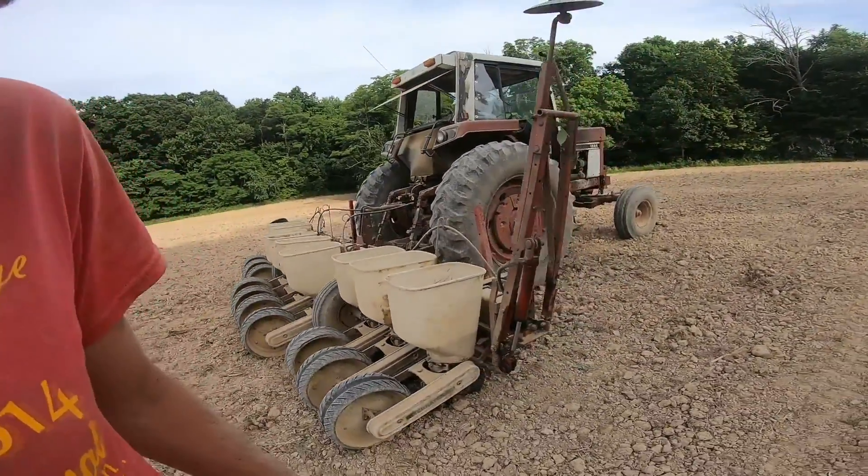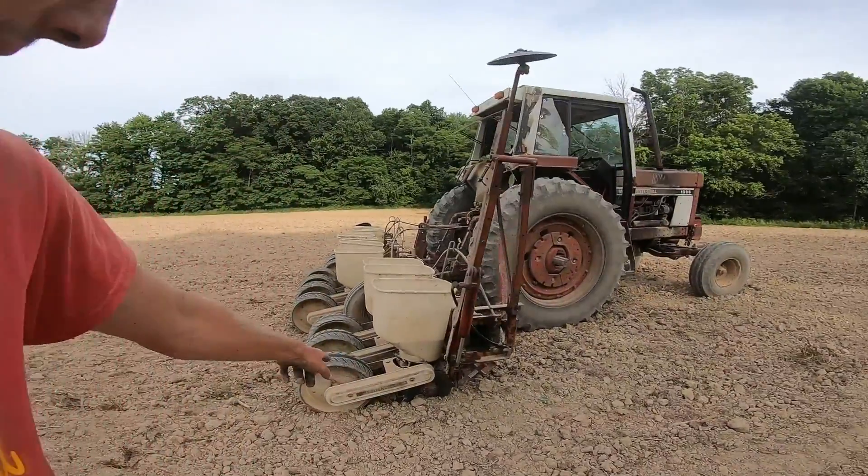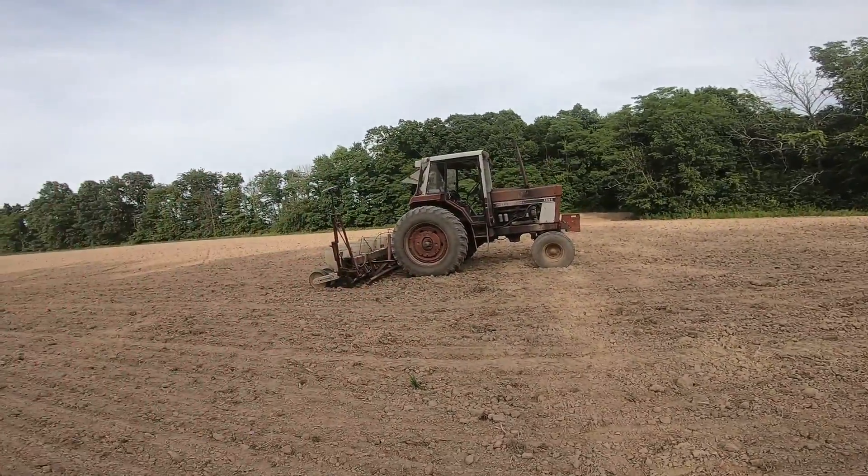It's dusty, it's dry. The old 295 units are still doing good. I've got to find — if anybody is in the IH group on Facebook, I made a post the other day trying to find the drive chain for these little guys. The pitch matches number 40, however the chain is narrower. In the dealer description it's called a 190, but in standard chain numbering that should be gigantic chain — the pitch would be over an inch, real heavy-duty big stuff. We found a couple dealers that have the chain here and there, but luckily we have a bunch of extra units we can Frankenstein for parts and got rolling that way.